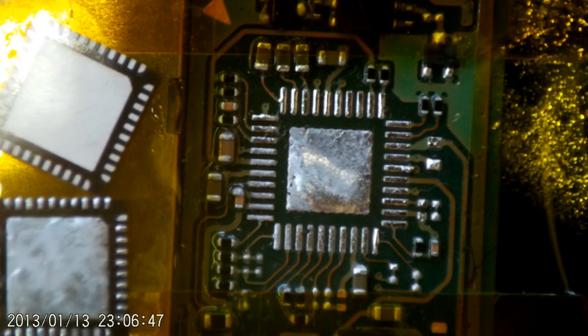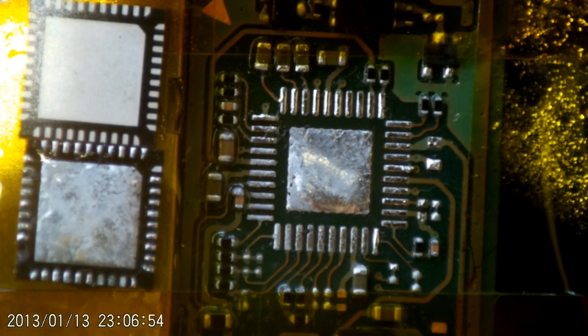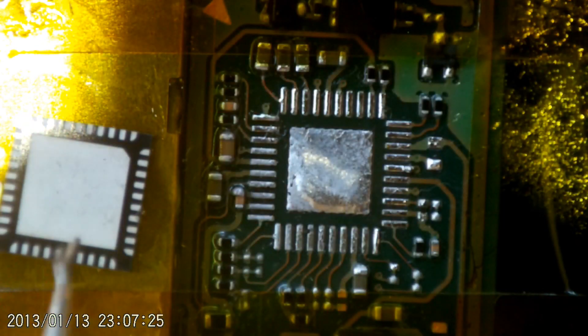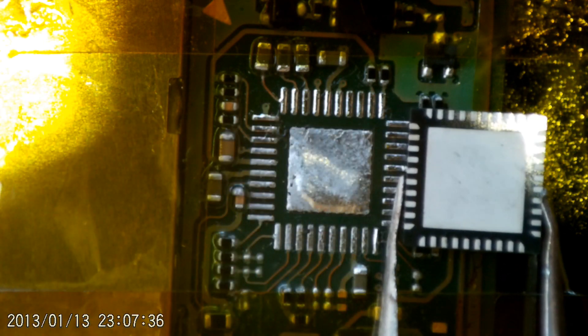So today on the workbench, this is the continuation of a teardown on a Nintendo Switch to replace the power IC. The chip on the bottom left is my first attempt of installing this, where one of the pins got a bit hot and decided to leave. To the left I have the potential replacement chip — and for the keen eyes looking, that's the correct orientation of the M92T36. The dilemma with the other one was aligning it correctly.